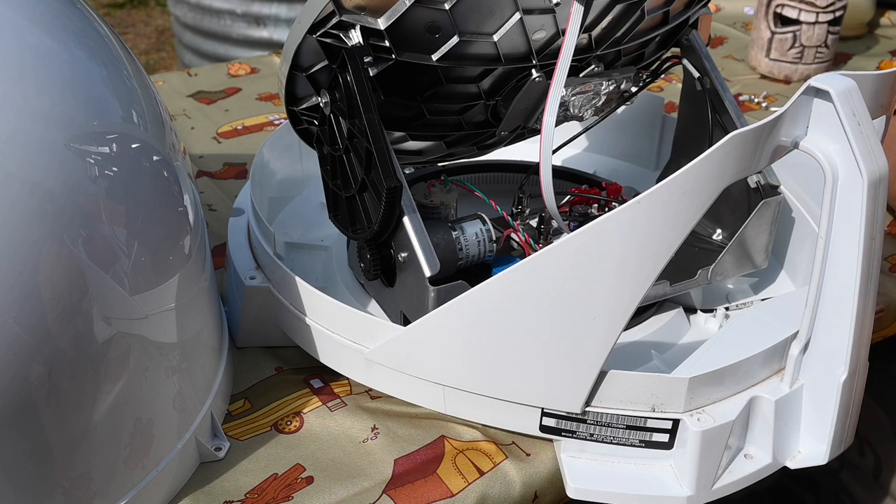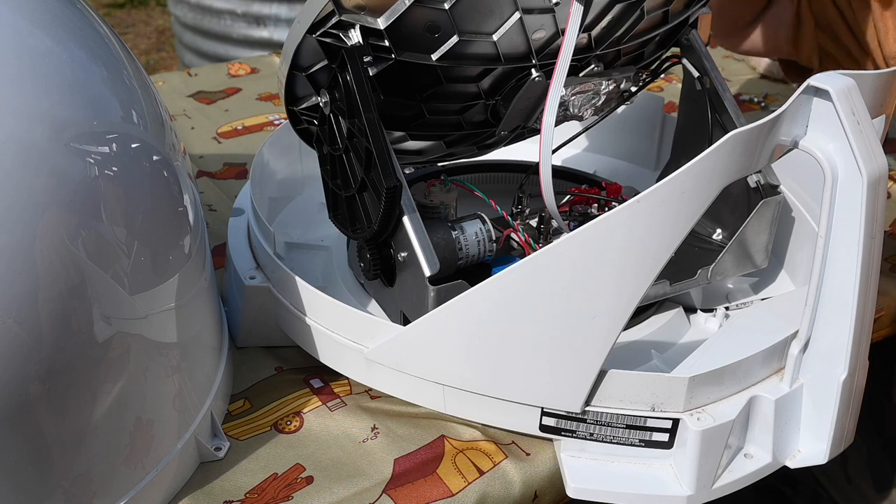This board uses the same coax as the received broadcast signal, so there are actually two signals on the coax simultaneously. DC power for operating the antenna also comes from the receiver using the same coax. So the coax performs three simultaneous functions — pretty neat.